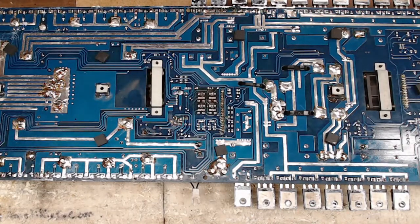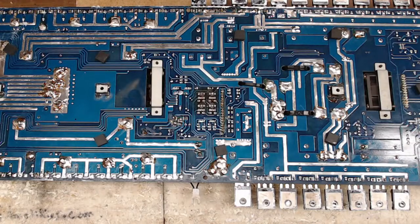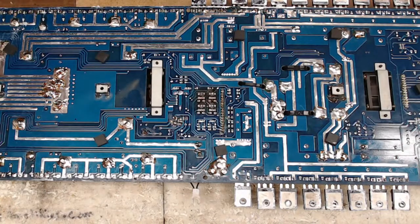Those TO-247s. If I needed to pull the outputs and all the outputs were still good, then I use the desoldering gun and desolder each pin and pull the transistor out. Whereas if I had a chisel bit tool for the gun, I could heat them all up at the same time and just roll that transistor out at that point, but I don't have something like that. Another thing on the old to-do list. Yes, everyone does have a personal method.